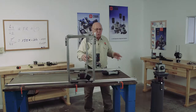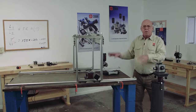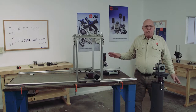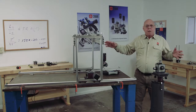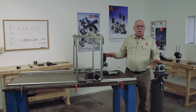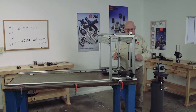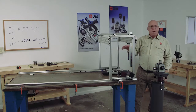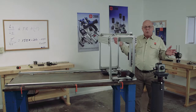So we may have to — when you're setting up the machine — this is another thing I like to mention to people: the base of the machine is the heart of the machine. If the base isn't right, the rest of the machine is never going to be right — you can't make it right above the base. It's like trying to walk with no feet. If the base isn't right or you have a short leg, you're not going to be able to walk right. The base has to be right. If I was to go in and check a machine, that's the first thing I'd do — check this XY axis. If this isn't right, my squarenesses will never be right; they'll be different in every position.